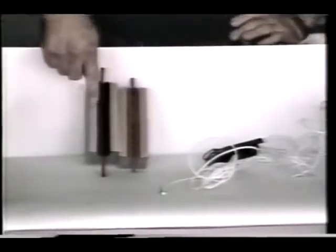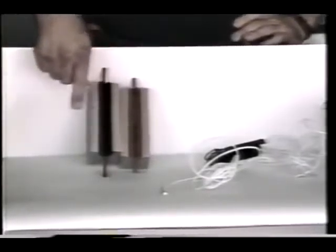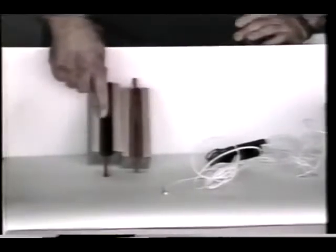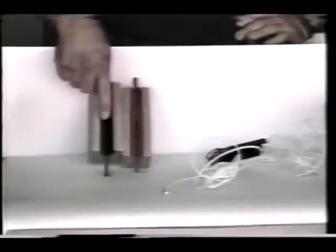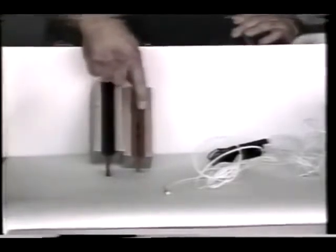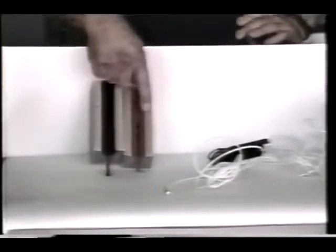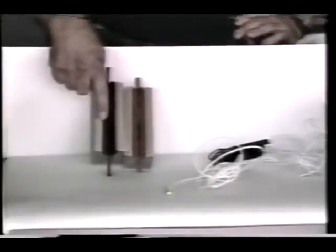These are the two explosive cutting charges that we've designed to enable officers to instantly cut the locks or hinges off a door. It's much faster and much safer than the old style procedures of kicking or trying to use a battering ram. We have the model 530 and the model 531 charges. The model 530 has approximately half the explosive that the model 531 does. We've found in practice that the model 530 works for any hollow core and most solid core doors. If you have a very heavy door or the standard industrial hollow metal doors, we'd recommend using the model 531.